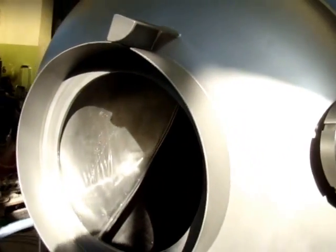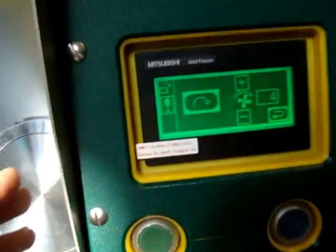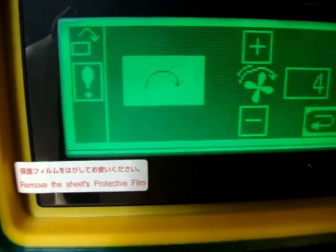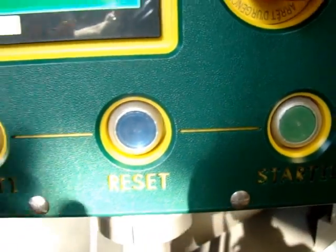And the machine will be without the cover. The worker has to enter unloading mode, push this arrow. Now it's lighting. And these 2 starts he has to push at the same time. And then the machine will start to work.